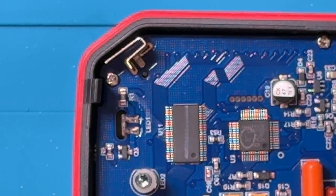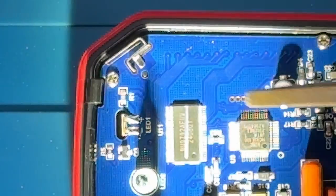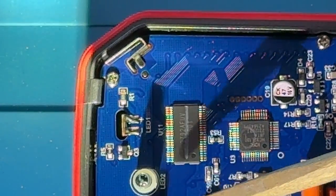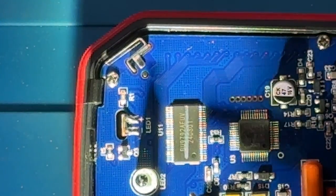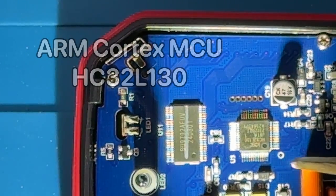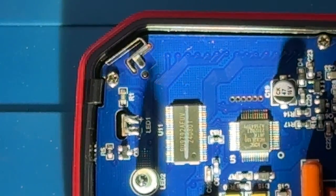So zoomed in, let's have a look at the different areas here on the board. We can see in the upper corner — that's the non-contact voltage sensor. We've got the LEDs for the USB transmit and receive. Then this chip here — that's a BU9792, so that's the LCD driver up there. This one over here is an ARM Cortex microcontroller, HC32L130 — a little microcontroller there.